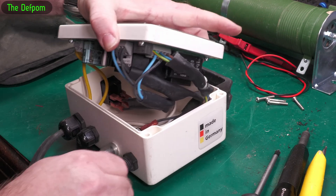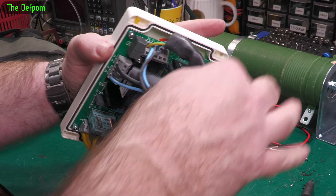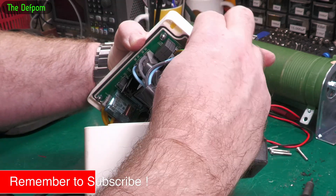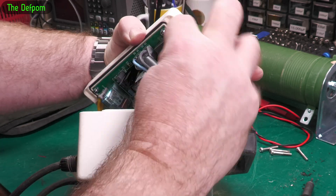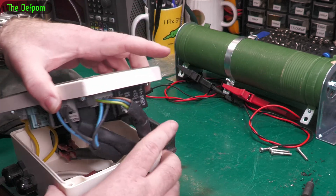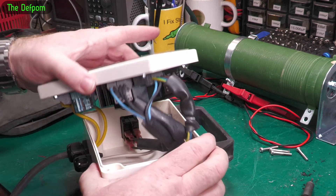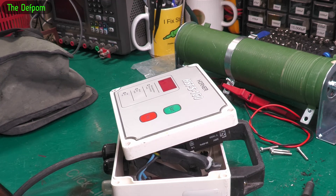Just making sure all the cabling inside is okay. The cabling comes up here - it's got this insulation, just as a precaution. Make sure the cables are all in there nice and firmly - these are like spring clips; they push in and lock. There's no screws. They all look okay, no issues there. So it's just sorting this gland out. I'll leave some slack inside the box as well, so if it happens again, at least you've got a chance to catch it.